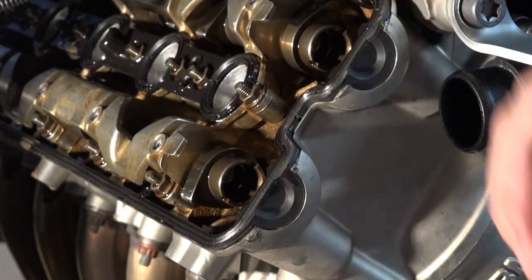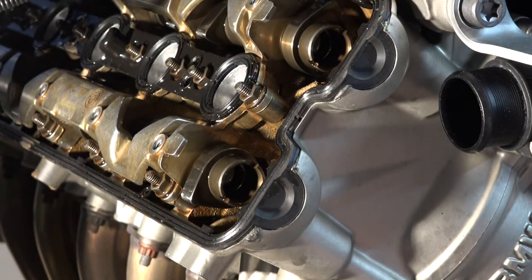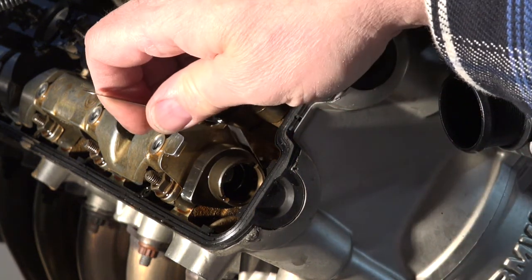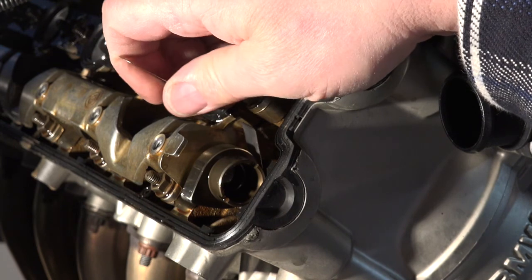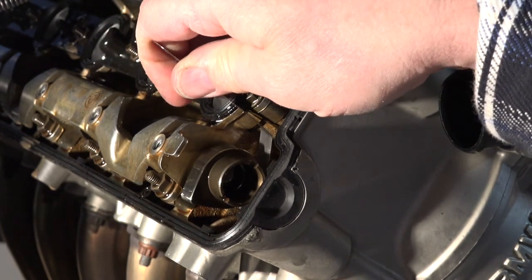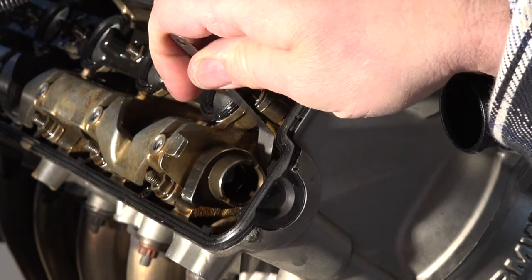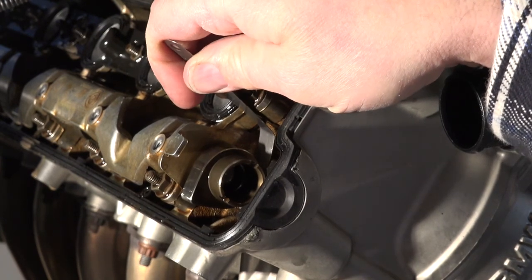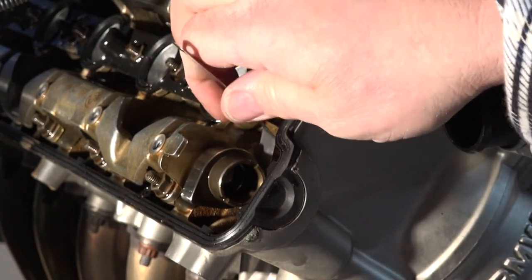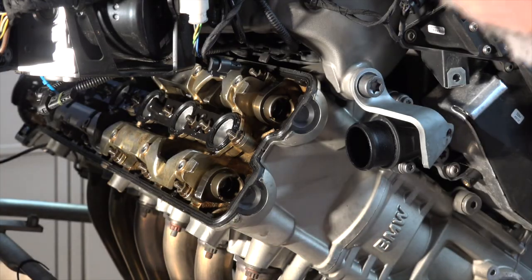The lowest value, the 0.23, slides right in. Now I'll put the 0.33 in the same way — I'll attempt to slide it right down the lobe and see if I can get it in between the lobe and that bucket — and I cannot. So I'm going to be happy with this one.